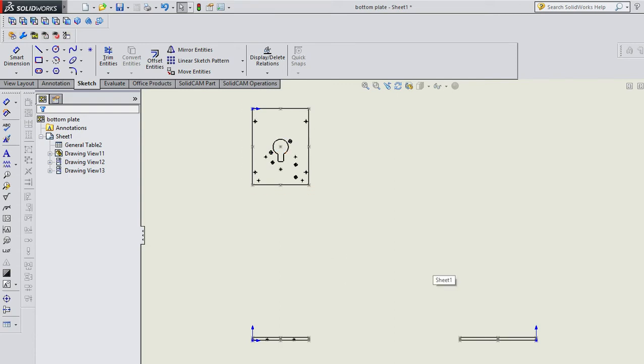So when you go between views, let's say I'm looking at this eraser and this is a view. When I go up to the next view here, or the next view here, or here, or here, the convention is for you to pretend that this sheet you're looking at is a bowl, like a bowl of cereal. And this thing's in the bottom of the bowl of cereal. And if you move from this view to any other view, it's as if you're sliding the piece up the side of the bowl. So that, like that, like that. Okay? Do not confuse people, because that's the standard convention.